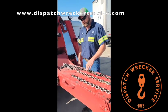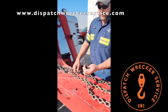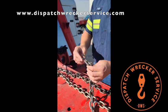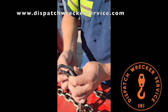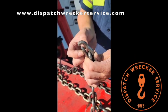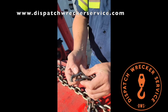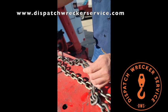And when you put over 7,000 pounds on a 3/8 70 grade chain, you end up with a link that looks like this, and it has disconnected from its device. It is now Bluetooth. And if you look in there, you can see where it broke at first and then sheared the rest of it off, and that's usually what they look like. This is from pulling too hard right here, and the chain that was connected here pulled out of it.